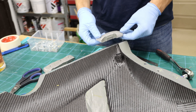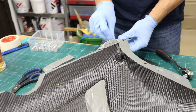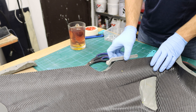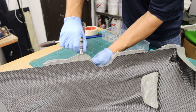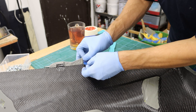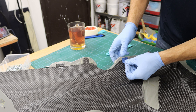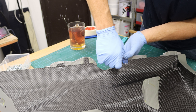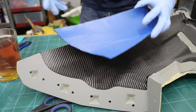Between the two layers I added the side flanges — the small molds are easily bolted on. I laminated four layers of prepreg into these molds as well: two layers of 225g and two layers of 450g prepreg. In the end, I overlapped with the last layer of 416g carbon.